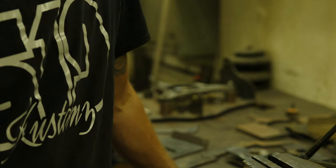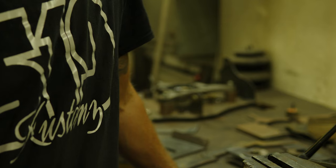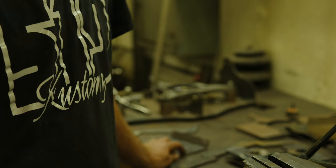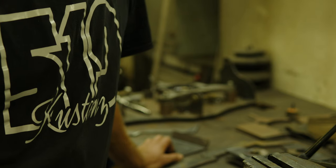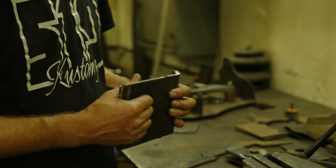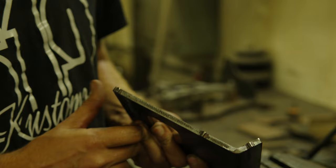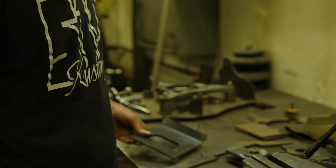Yeah, so I guess, look, designers, I want to talk to you guys. Designers, engineers, aspiring designers. If you want to be the best you can be at your job, school is great and all, but get your ass in the shop and build something. There are all of these little things you pick up that make you a better designer or engineer. If you don't have an open communication with the guys that are fabricating your parts and you're just designing them, there are so many little tips that fabricators can tell you on what would make your design better. Just something as simple as adding these little tabs saves hours and hours of fit up work. But unless you got your ass in the shop and built something, how are you supposed to know that?